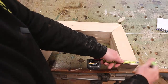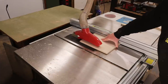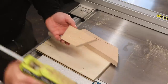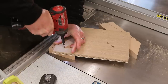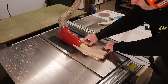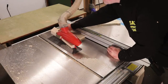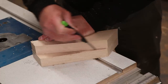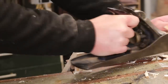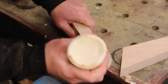I want my legs to be tapered so I mark up how I want that to look. My original plan was to create a simple jig using a scrap of plywood with blocks glued and screwed to position each leg consistently, then run that jig along the fence of the table saw. But I wasn't completely comfortable making these cuts as it's a small workpiece and my hands were closer to the blade than I liked. So for the rest of the legs I cut away the excess at the band saw and then worked up to my pencil line with a hand plane. I rely a lot on gut feel where safety is concerned — if it doesn't feel right there's always other ways to get the same results.